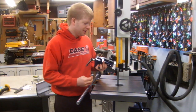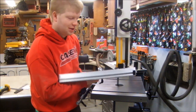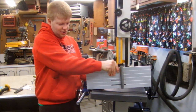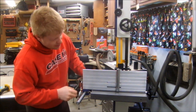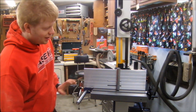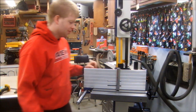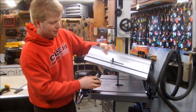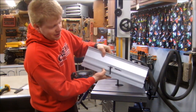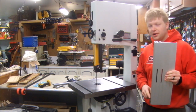There are a few things I'd like to point out on the fence on this saw. Notice there's one nylon pad on the bottom side of the aluminum piece of the fence. I can install it on the carrier, and that nylon pad at the end supports it — I have a nice even gap all the way down and can slide it back and forth without marring the table. The downside: if you're going to use the fence on the other side of the blade, you need to unscrew this pad and move it down there, otherwise you won't be sitting level and you'll scratch your table.